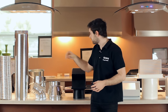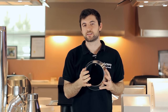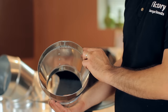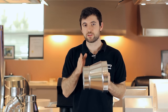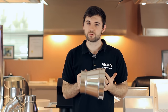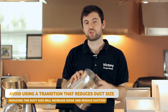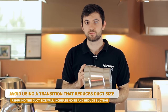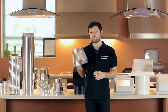So then you don't have to use one of these. This is an 8 inch on one side and a 6 inch on the other side — this will reduce the size so it will fit. However, it will also reduce the suction. Going from 8 inch to 6 inches will actually reduce the suction by about 50%. So if the duct in the wall is not changed and the reducer is used, that could be the issue. If you're looking to get the most out of your hood, we would recommend not using one of these.